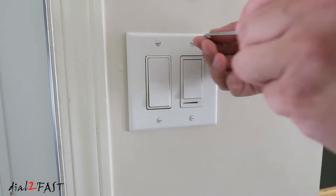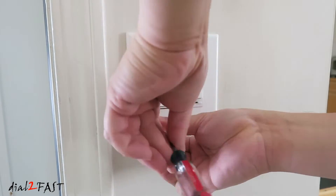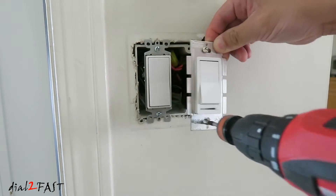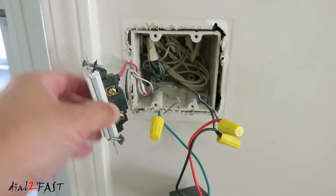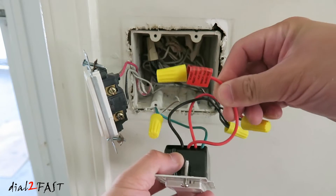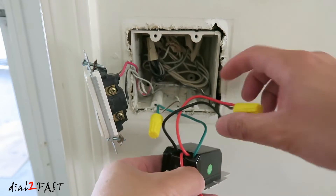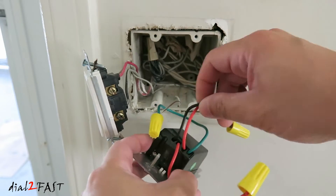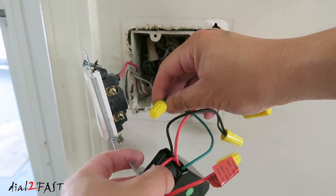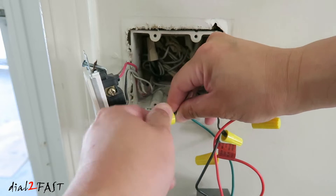With the power turned off, remove the plate on the switch. Next, pull out the switch. I've gone ahead and pulled the other switch out so you can have a better look at the wiring. If you look at the old dimmer switch, it also has four wires. This red wire is not used — it's actually for a three-way installation which I'm not using. This other red wire goes to the lights. This black wire is the hot wire, the live wire. And the green wire is your ground. Now for the new WiFi dimmer switch, I do also need to connect the neutral wire which is at the back right here. So let's first go ahead and disconnect these wires.